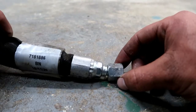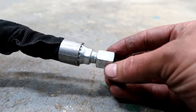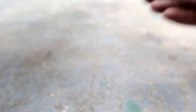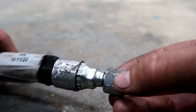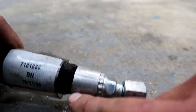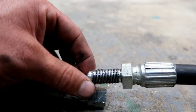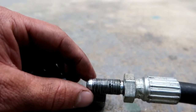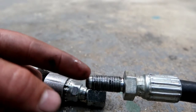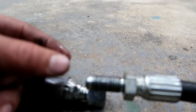Here's a look at that damaged line. As you can see, this head is kind of set on an angle — that head should be straight coming off. This is what it should look like: a little bit of looseness to it but able to squarely screw on and seal. So obviously it hit a rock right there where it's all scuffed up. I actually think some of that scuffing is from me taking it off. It hit a rock right here, bent it up, and this only screws on a few threads, so in doing so it actually bent this upward.